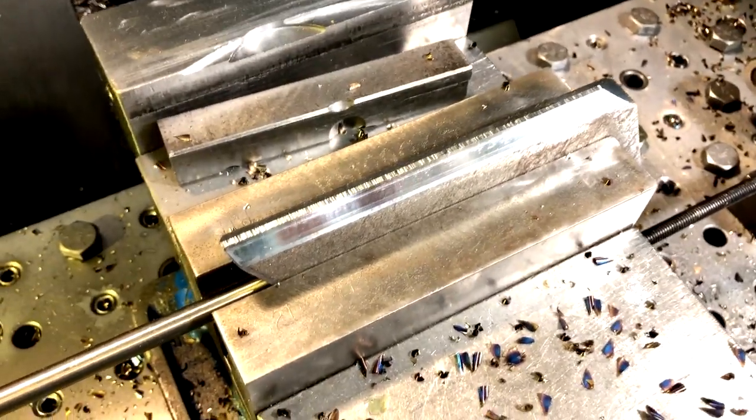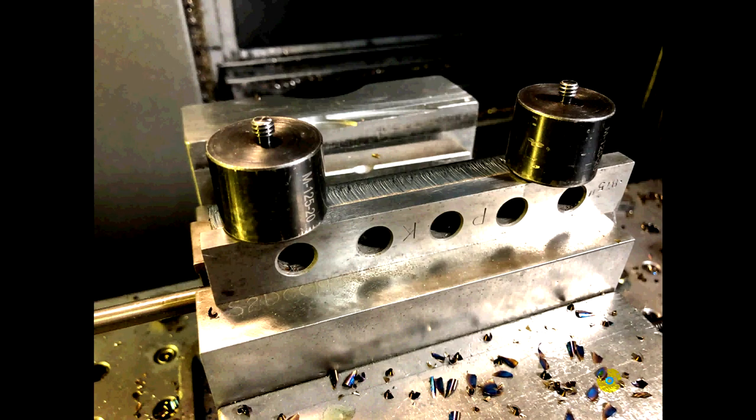Quick and easy, repeats every time — and that's how you get around that. Here's one final look at the setup. These two pot magnets — I have a lot of magnets, some from the hardware store, some collected over the years. This happens to be a seven-eighths parallel that I built around 1980, still working well. It's up against the part we're machining and up against the vise jaw, putting me nice and parallel. You could put a level on it too — I just think this is faster.